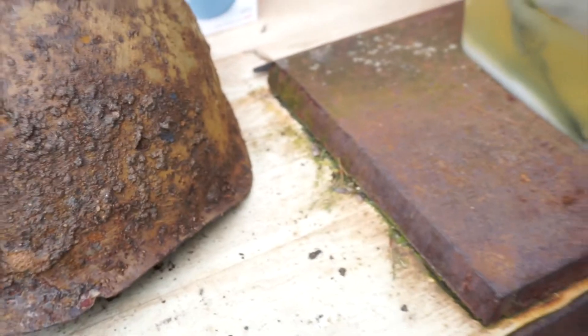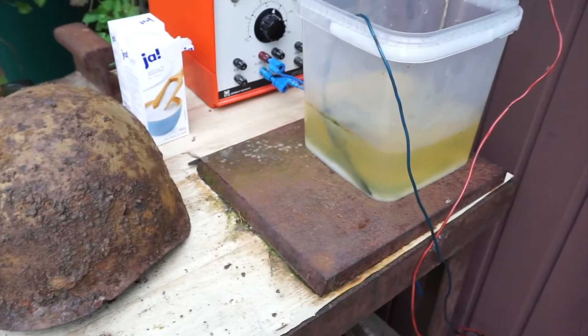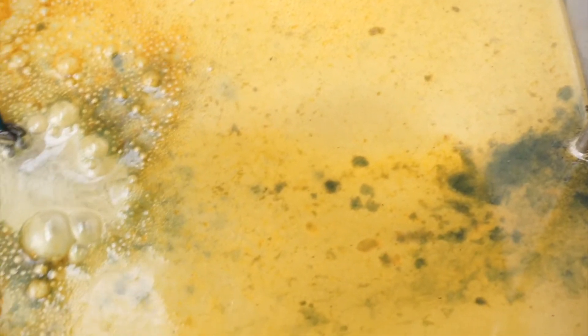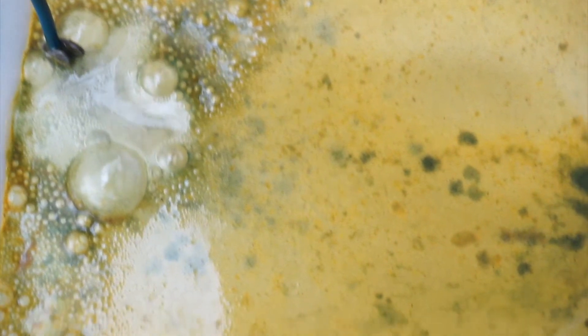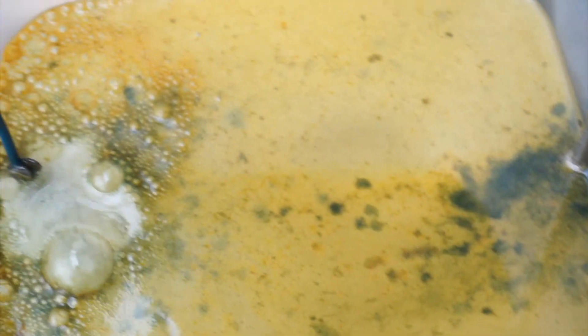So step two, I did a little research. My brother-in-law and I are attempting to do some electrolysis. Currently, we're running at about 15 volts — this is a 10 amp machine. We've got a solution of water and salt. This is a rusty nail that we put in there as a test run, as we've never done this before. And as you can see, the water is just turning orange and green, and that rust is just bubbling right off that nail. It's working fantastic. We've got to find a bigger bucket — if this comes out good, we're going to do the helmet next.